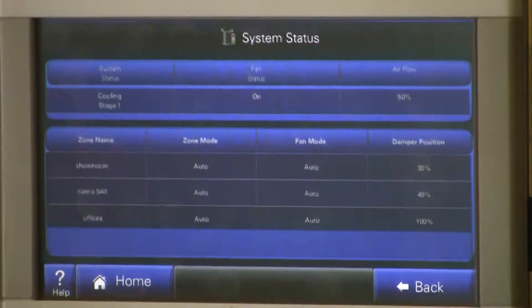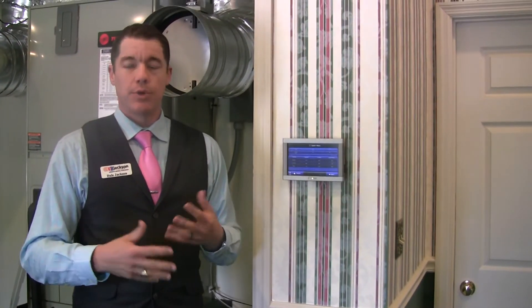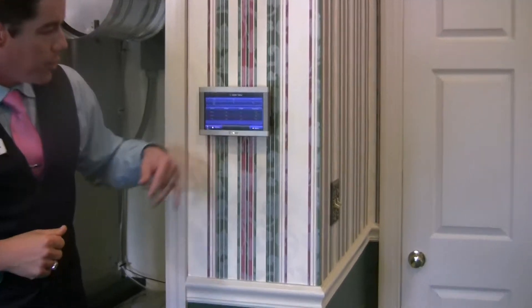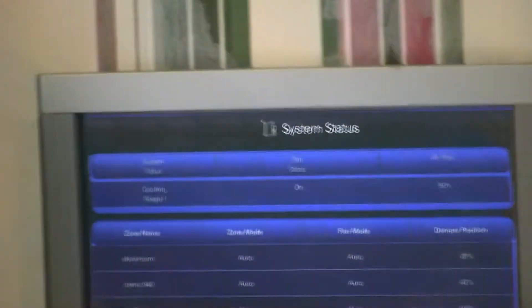The intelligent part is our system is only on and operating at 50% of capacity. This particular unit, instead of operating like a full three-ton system, is actually only operating like a one-and-a-half ton. So instead of operating as an 18 SEER system, it's actually operating somewhere around a 24.5 to 26 SEER, which is exponentially more efficient. As we're sitting here talking, these dampers are constantly opening more and less because we're diverting the air and measuring it at such a fine level — you can see we're now looking at 31% and 44% open, so just a small adjustment puts more or less air in different parts of your home.